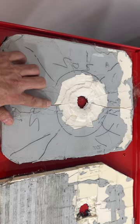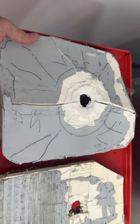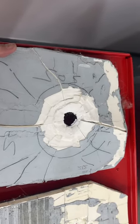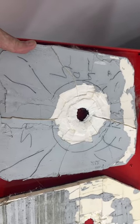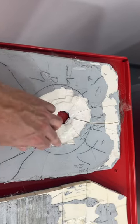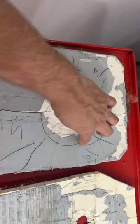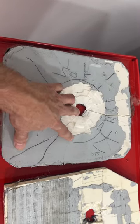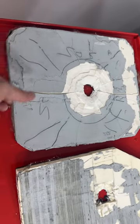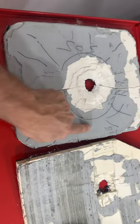You get a resultant lower BFD on the first shot with a monolithic plate. But the downside is that the monolithic plate unpredictably cracks everywhere, so you don't know when the next shot goes in whether it's going to hit one of these thinner areas surrounding about a two-inch radius around the projectile entry point or into one of these major cracks. I traced the cracking with a black marker so you can see it.